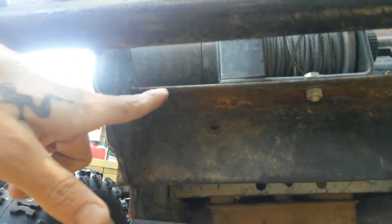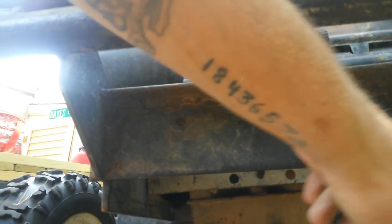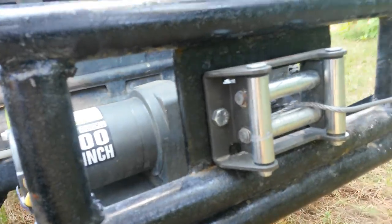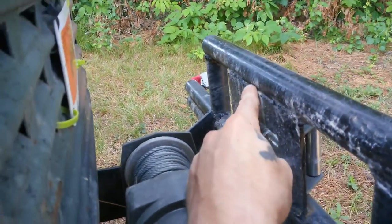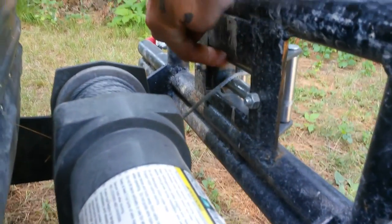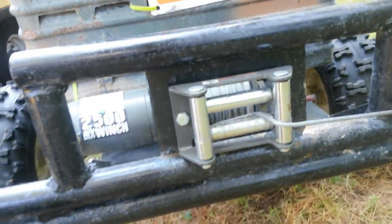There's a plate of steel here — that's the plate the winch is actually mounted down to. This is a cross plate that's just stiffening up the whole front end, and the winch is bolted down with just the regular winch mounts. Then there's a plate here — basically it's a piece of quarter-inch by four-inch plate steel, same stuff I used for the side brackets. It fit well on the back side, so I just ground it down, welded the ends with a little stitch on top and bottom, cut a hole way bigger than where the cable's gonna go through for the fair lead, held the fair lead there, marked the holes, and drilled them.